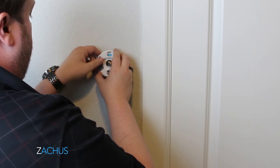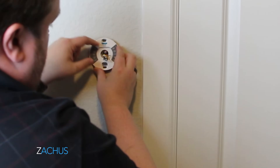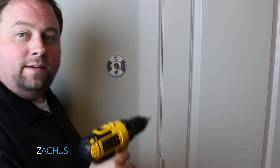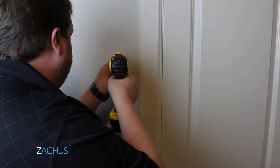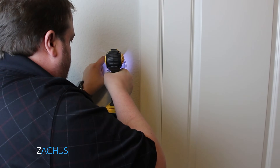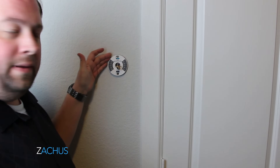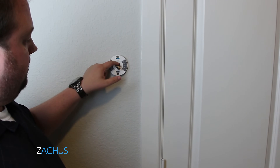I'm going to go through the hole — feel free to let the standard electric wires go through. It even has a leveler built in so you can get it nice and level. I have my handy Dewalt. Just going to make sure that bubble is right in the middle and push it in. You don't have to get it too tight — you don't want it to bend or break the sheetrock, just nice and snug so it's not moving around.